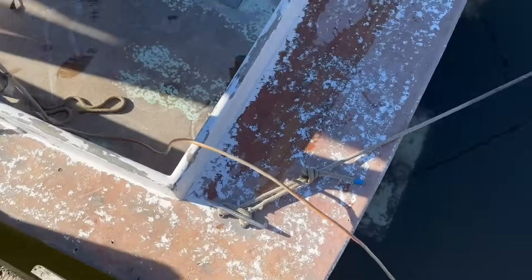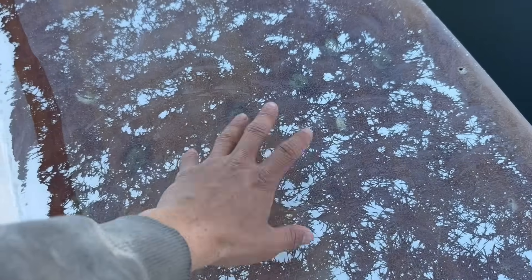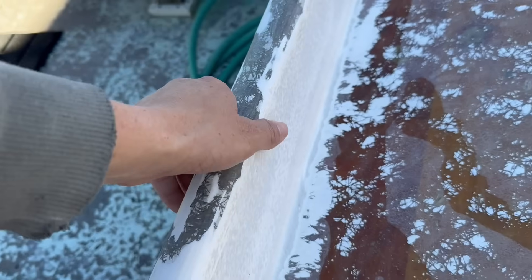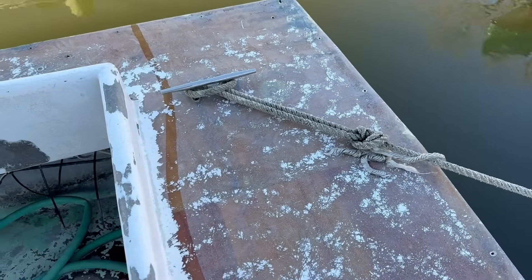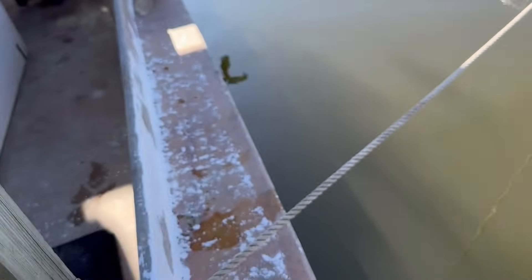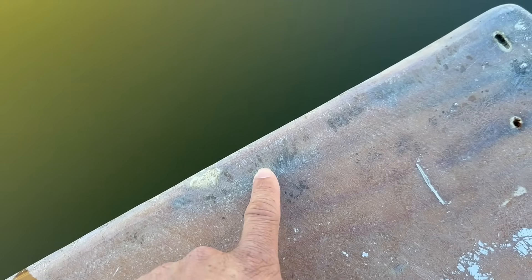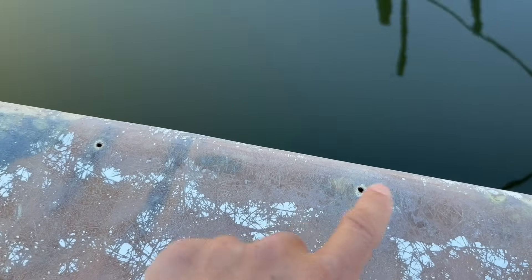We'll get on board here and take a look at her. So all this had a gray primer stuff on the glass and then a white stuff on top, and we were just going to rough up the white, but it was starting to peel up — it wasn't bonded properly. So all the cleats, all the little rub rail and stuff, we had to take all that off. I'm going to have to drill out and fill all these little screw holes and then re-drill everything.